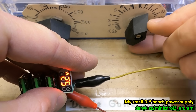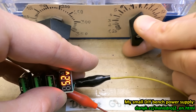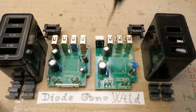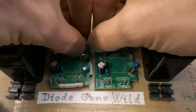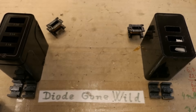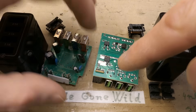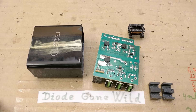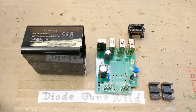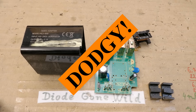Let's demonstrate the fake voltmeter by connecting it to my bench power supply. As I change the voltage, the reading doesn't change — it just changes its brightness. There's a space on the board for a second secondary capacitor in parallel, but of course they didn't put one in. The isolation distance on the board is actually slightly better in this one, but it still could be bigger. The synchronous rectifier is a nice bonus, and I'm not sure if I should call the fake voltmeter a bonus, but it still can only supply 2 amps — not 3.1 as it says. The capacitor is not a safety capacitor and the insulation in the transformer was horrible. So the conclusion is... DODGY!